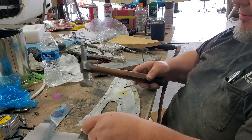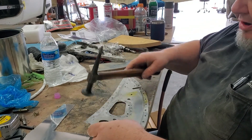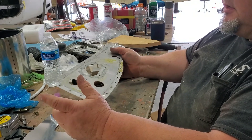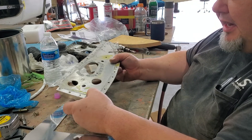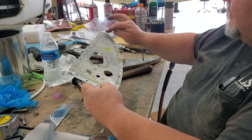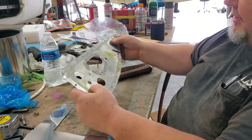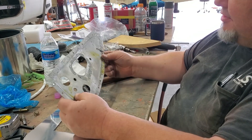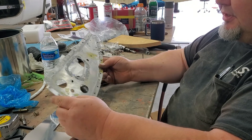To flatten this out, I just took my trusty body hammer, went on a nice flat surface, and pounded it out all the way around. Then I took it in my English wheel and set it tight enough that I could roll out the little edges that get formed over when it gets bent. This had a little tiny flange here, and you can see this corrosion — so we're getting rid of some cracks, some oversized holes, some corrosion, and other stuff, and making it a nice new clean shiny piece of aluminum.